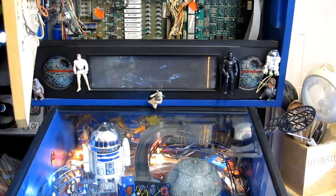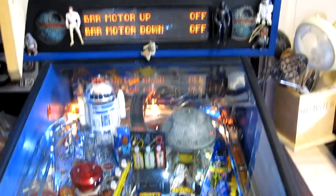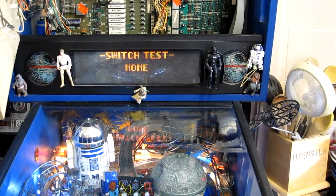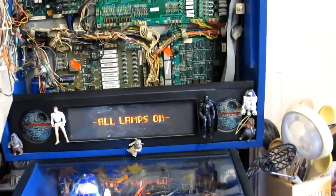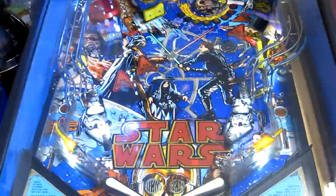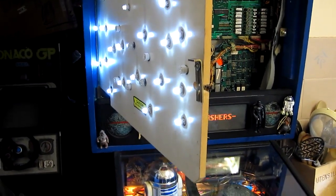It's a quick DMD test — I assume that's working fine, I've just seen the graphics are fine. Ball trough motor — that's working fine. Switches are fine. Trough switches are active, that's all fine. More lamps. Looking good on the flasher front — I think that's all of them flashing. That's not — no — that's all flashing. Looks good.